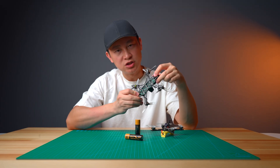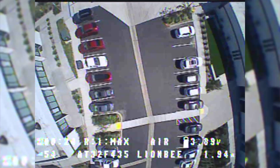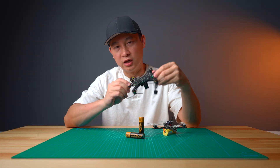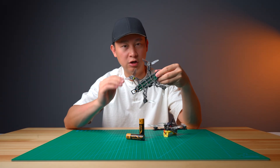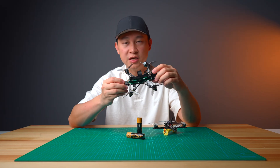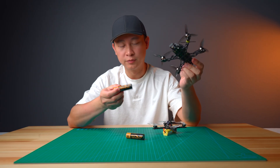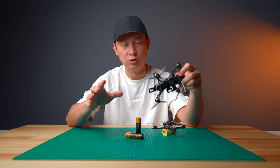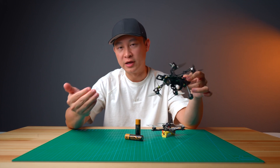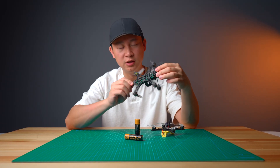On this ESC, we use 2N channel, so it can go up to 20 amps per each channel. I was literally just doing freestyle with this drone and it's so fun — you have the power and you also have the flight time. It can handle a one-cell battery power as low as 1.8 volts, because we want to have a stable 5 volts to support the VTX power. This type of battery has a cutoff voltage around 2.3 or 2.4 volts, so when it gets too low the whole system can still operate normally. The VTX power on this prototype is around 800 milliwatts.